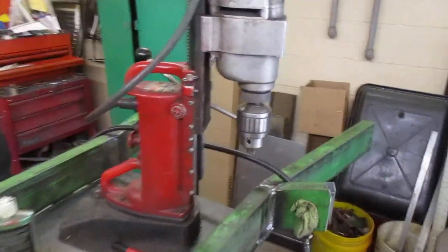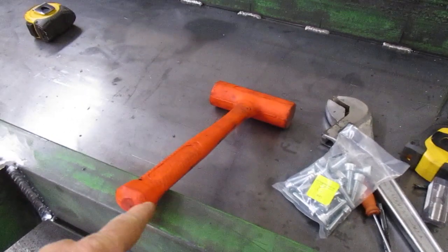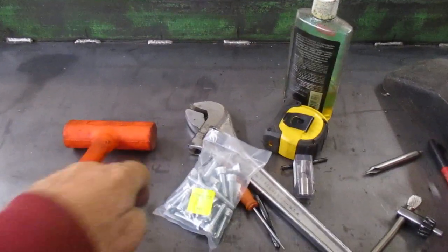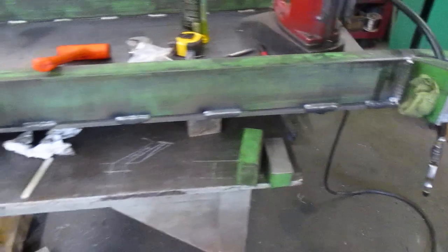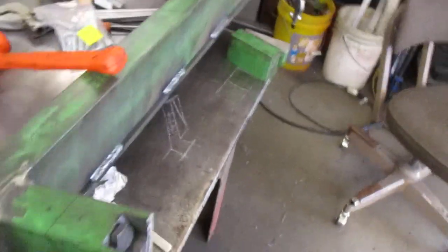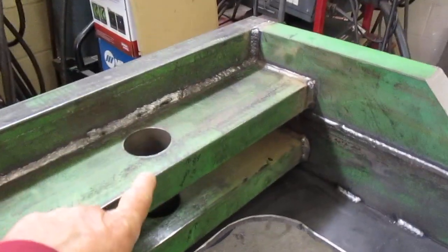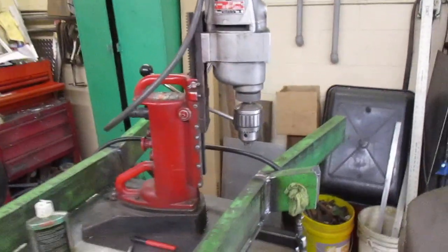Here's where we're drilling and tapping. It's going to get a bar that comes over — a three-inch piece — to guide the slider so it can't pop out. The bottom plate is half-inch thick and it's going to come out and spread at the top. The table is going to be eight foot long, three foot wide. Got the bronze bushings in there, made so they can go on and off. This material is an inch and a half wide and four and a half inches thick. That old mag drill will drill and tap them — still takes a lot of time.